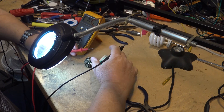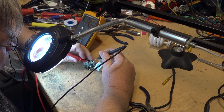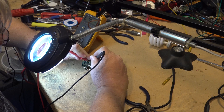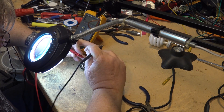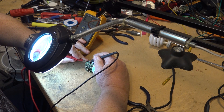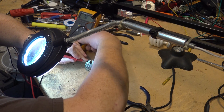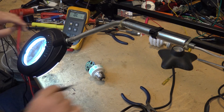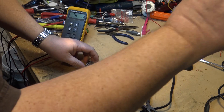I've got my meter in regular ohms mode. Checking the first capacitor — that one looks okay, it's open. Now the other one over here is measuring 0.2 ohms. That capacitor is shorted.